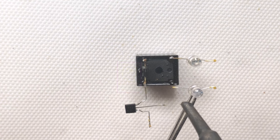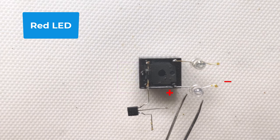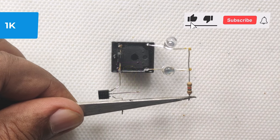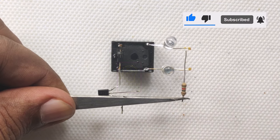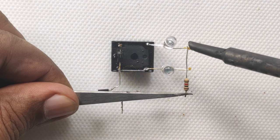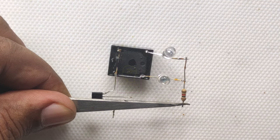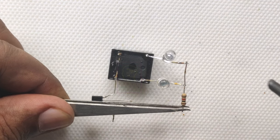Here, once the battery becomes fully charged, then TL431 will disconnect the battery from the charging voltage with the help of relay. Once the relay cuts off the battery, the relay will not re-energize and connect the charger to the battery. Thus, the battery will be safe from overcharging. We need to disconnect the input and reconnect for again charging the battery.